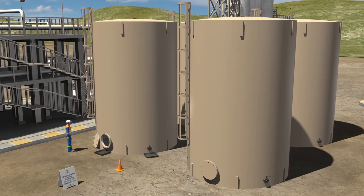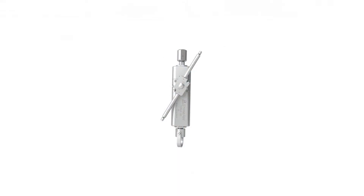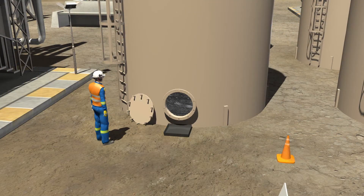In this method, the cleaning team will enter the tank with a gamma jet — a high-volume, low-pressure wash tool — and/or a 3D tool — a high-pressure, low-volume wash tool that is attached to the high-pressure pump or chemical unit. During the cleaning process, the man door is closed.